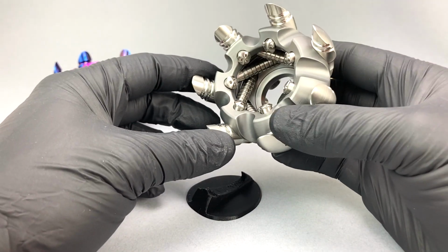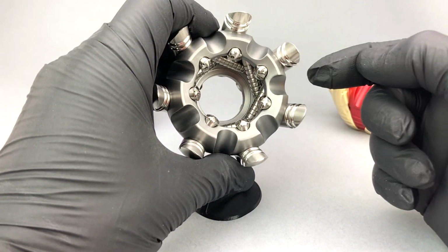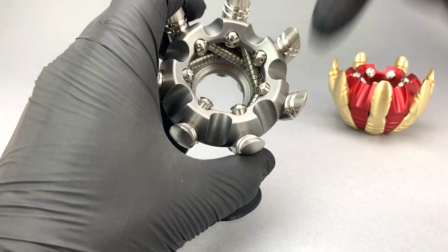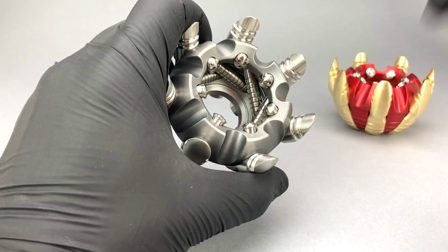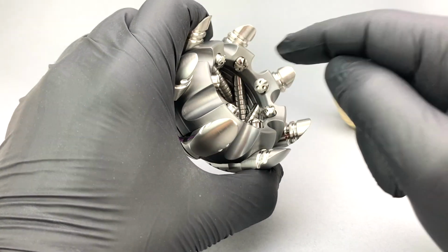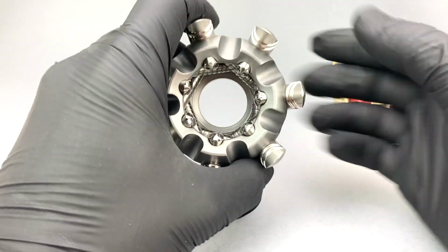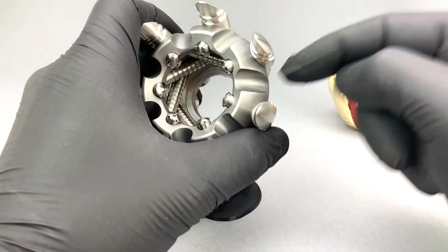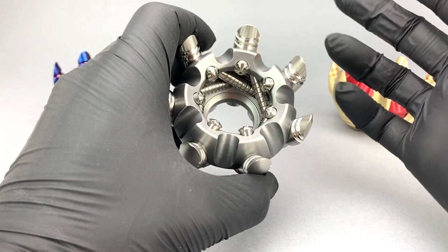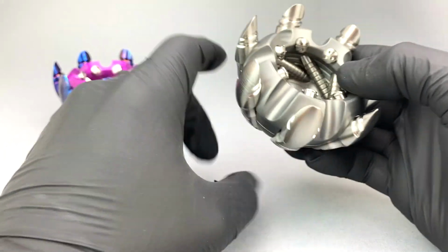One of the things I worked with is just how to get this threaded pattern in here. I knew the way to do that is to drill a series of holes on an appropriate angle around the circumference of an object and then bore that out. But actually sorting that out in a way that worked, that made sense, and that was aesthetically appealing was the hard part. Originally the ends of these were protrusions that were just going to be their own cap, but from an aesthetic standpoint, that seemed really obvious and simple, and it didn't really work.